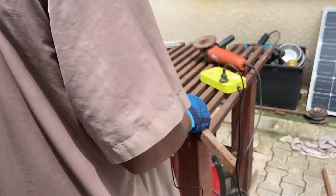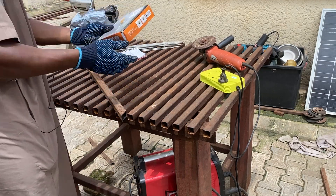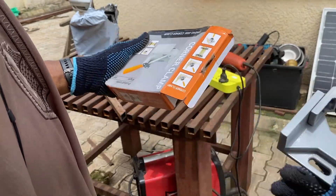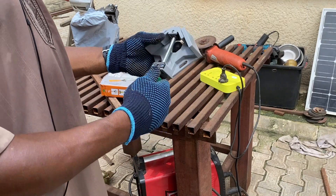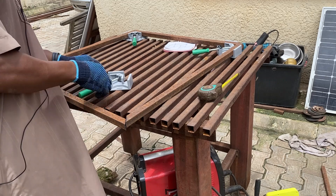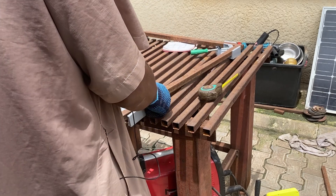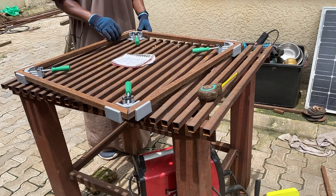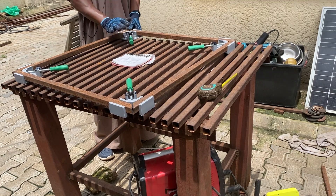Now we want to assemble them. I got these square clamps that clamp to the edges of the pipes to keep them in place for welding — I'll put the link in the description. I got four of them for the four edges of each part of the table. You can see they are clamping the last one here, holding them in place so the pipes will not be moving or wobbling.